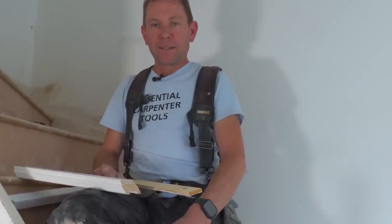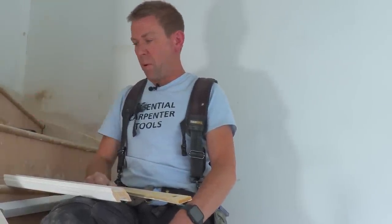When you call them sticks, that's a colloquial term for spindles — they are actually spindles. We're not suddenly putting sticks in, but you call them sticks, because that's fine. So that's the first thing. The second thing is, do we still need to maintain that 100mm maximum gap between spindles, so that a child can't get their head through? Yeah, 100mm or less. I'll set them up at 90 — I like them a little bit under. 100mm is a bit wide.